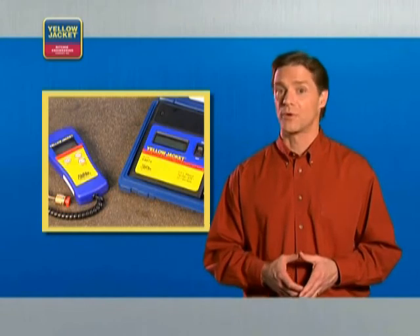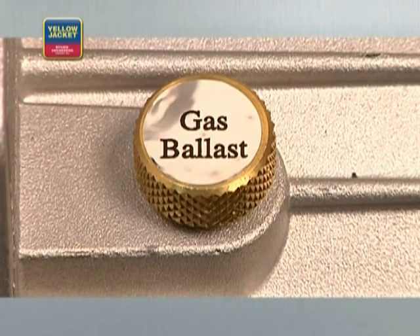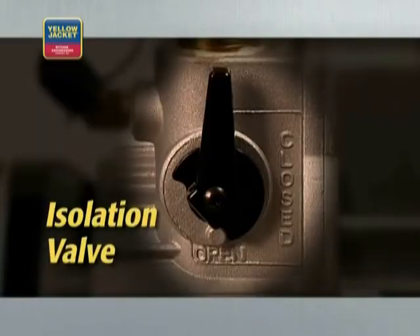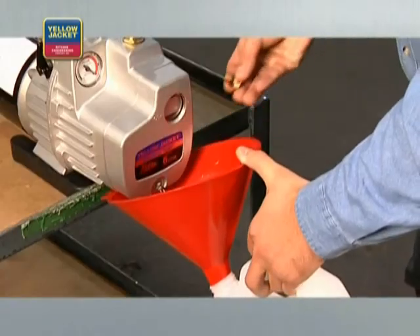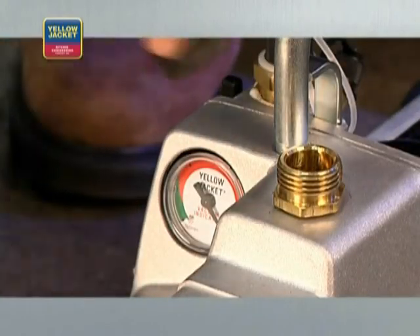Also, it's a good indication of whether or not your system leak has been fixed. If you can't pull into the green range of the vacuum gauge indicator, your system still has a leak. A feature unique to this Yellow Jacket Super EVAC vacuum pump is the gas ballast valve. When opened just a bit — loose enough to move slightly — a limited amount of air can enter the pump. This air helps exhaust water vapor instead of allowing it to mix with the vacuum pump oil, which is especially helpful during the early stages of evacuation when you're removing mostly water vapor. The isolation valve allows you to shut off, drain oil, and refill the pump without losing a great deal of vacuum, saving a lot of time when oil changes become necessary in the middle of a job. Finally, the exhaust fitting on this unit is sized for a garden hose attachment, so you can exhaust to the outside if necessary.